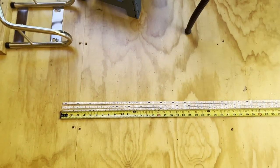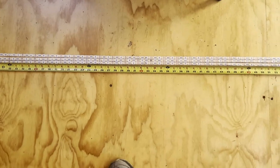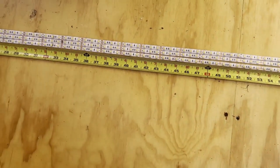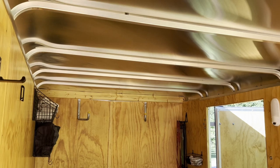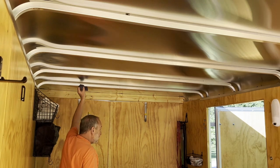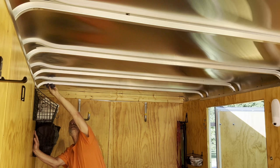I laid out the LED tape pieces along the ruler and marked each one for the center, which works out to about 32.5 or 33.5 inches — because one is a little longer. The center's a little bit off, but this is going to guide me on the placement on the rails. Correspondingly, I also put a centerline mark on each one of the beams where I'm going to be putting the tape. So all I have to do is line up those marks and the tape will be evenly spaced on both sides of the beam. Before I apply the LED tape to the inside of the beams, I'm going to clean them off with some lacquer thinner — just make sure there's no grease, grime, or dust — so I get good adhesion with the 3M tape backing.